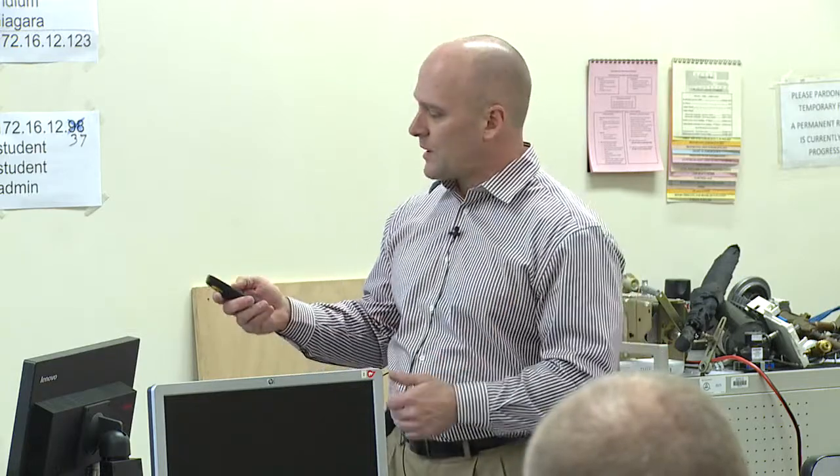Okay, so the purpose of the exercise is to provide an engaging exercise you can use at your home institution to develop competency in constructing 4 to 20 milliamp circuits. We're going to do a two-wire circuit. This is a sinking circuit from the perspective of the controller. We'll talk about that. You'll gain broader experience with peripheral devices.